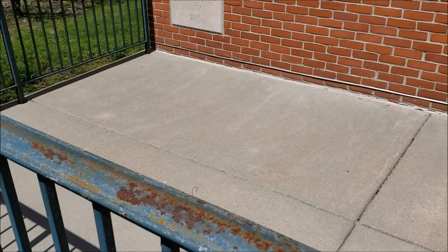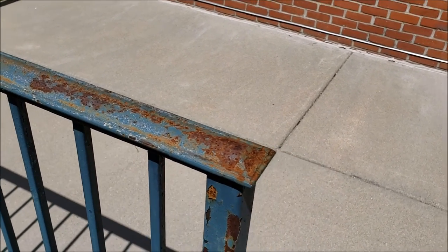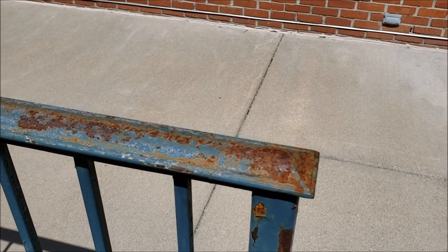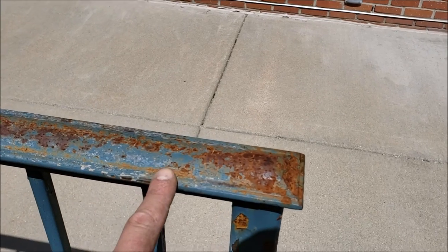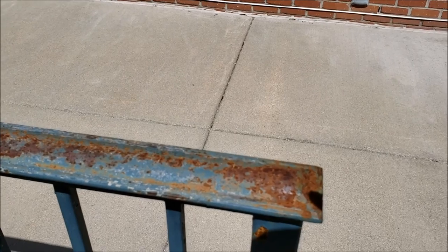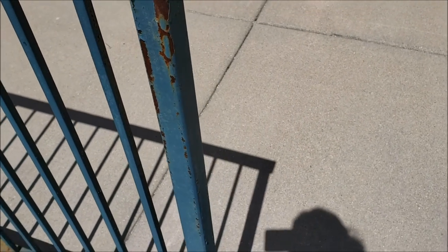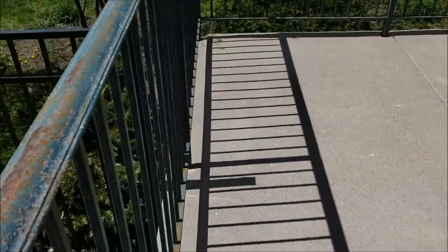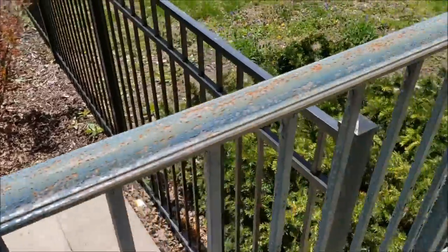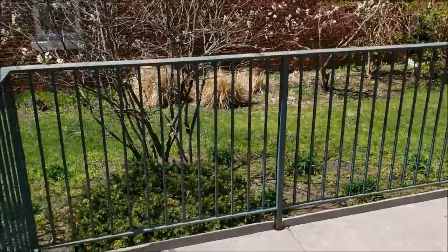We're at a local church where I live. I've got a painting project and a few other things to do, and this is where I started today on Monday. These handrails — this one hasn't had anything done to it yet. They're rusty, with peeling paint. You've got to sand them and wire brush them down. I've got a wire wheel to put on the drill, and you can see all this green handrail has to be painted.